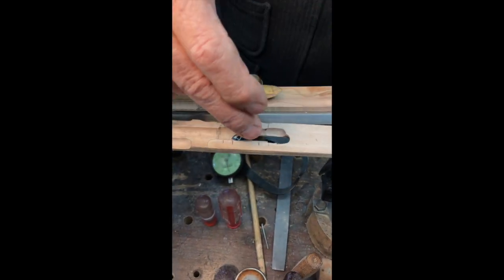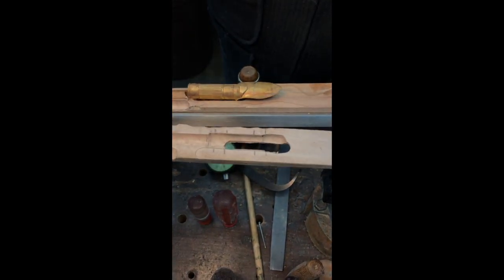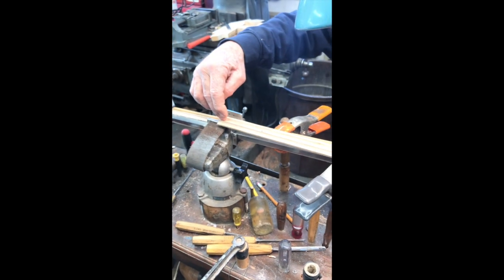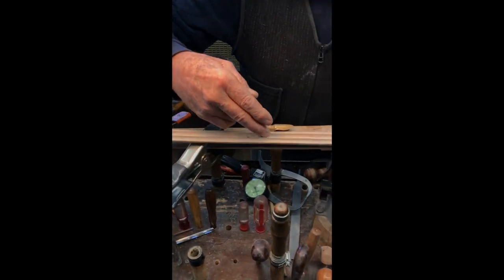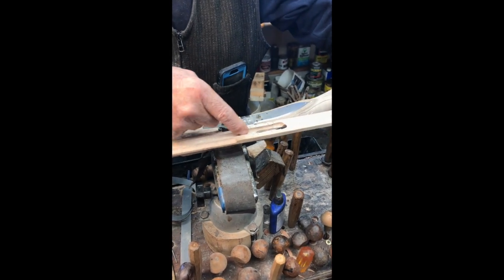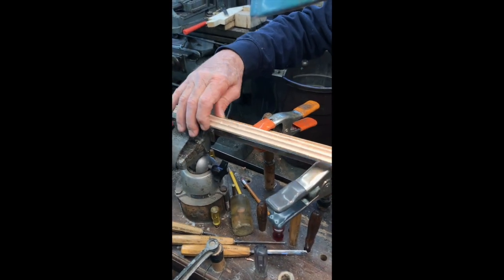Now this thimble is going to be cut right clean through the side panel. It looks like it's a mistake right now, but you'll see that it's going to work out. What we do is, when I cut this channel in here, the loading stick actually goes deeper as it goes towards the rear so that it will go underneath the side. So this groove here is 100 thousandths deeper on this end than it is at this end.